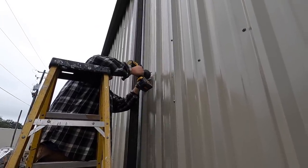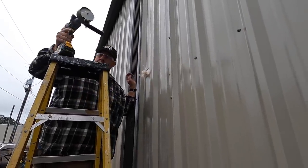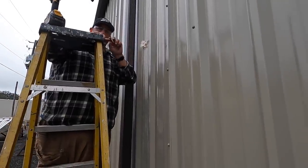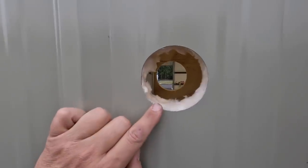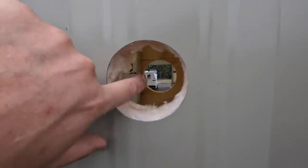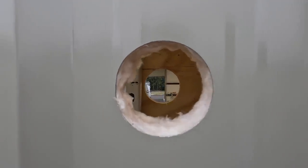There's our insulation. I'm going to just cut it and move it back up out of the way. There's our three and a half inch hole through the wall. I just reach in with a knife and cut the insulation nice and clean, and then we'll have our flanges come through here and hide all this, and it'll get sealed up. You can see the plywood backing there where our air handler's going to go.